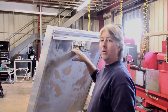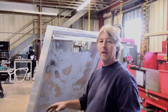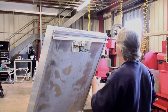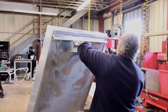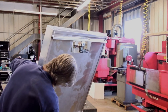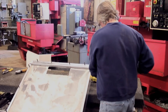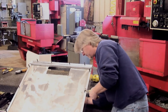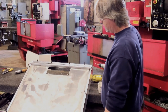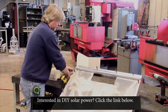As you can see, we now have the holes cut for our duct work to go in. We're going to go ahead and pop rivet this piece into place, then we'll throw our insulation in and hopefully button it up. That pretty much finishes up the drilling for the rivets — that's where all the clay goes — and now we can start putting the rivets in the thing.